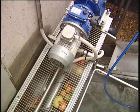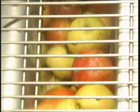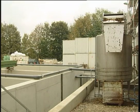While in the conveying system, the apples are separated from the flushing water. The speed of the conveying system can be adapted to the desired apple quantity via a variable gearbox. Afterwards, the apples are transported to the sorter belt via an elevator.